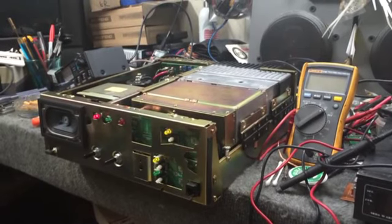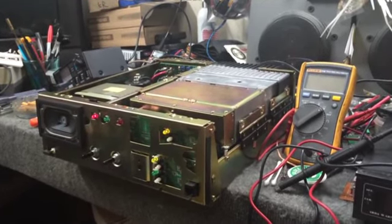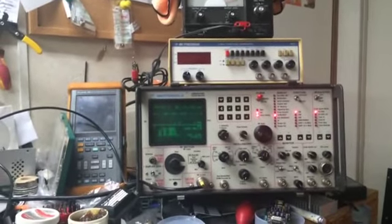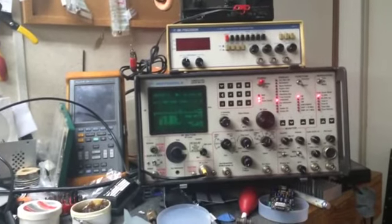Run about 3.8K of deviation. And what I have here is the watt meter pulled up. The amp that we have is supposed to be 8 to 10 watts in. Unfortunately, the lowest I can get this thing to do is 11.1 watts out. So, see right there. Now, amazingly enough, this thing was hooked to the amplifier. The amplifier is right over there. Previously, and was putting quite a bit out.